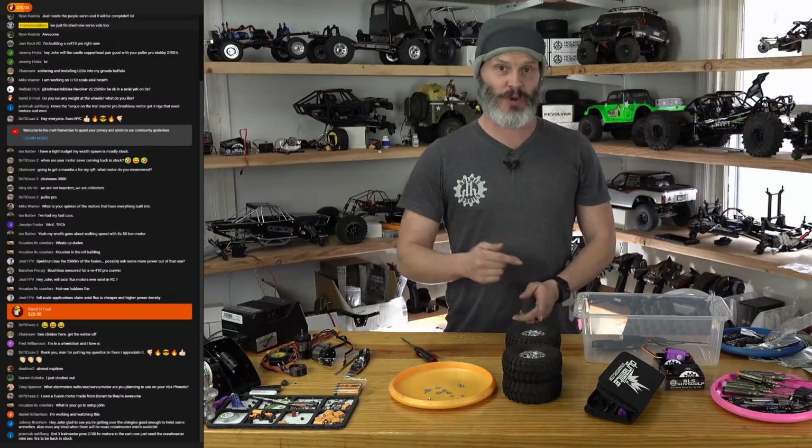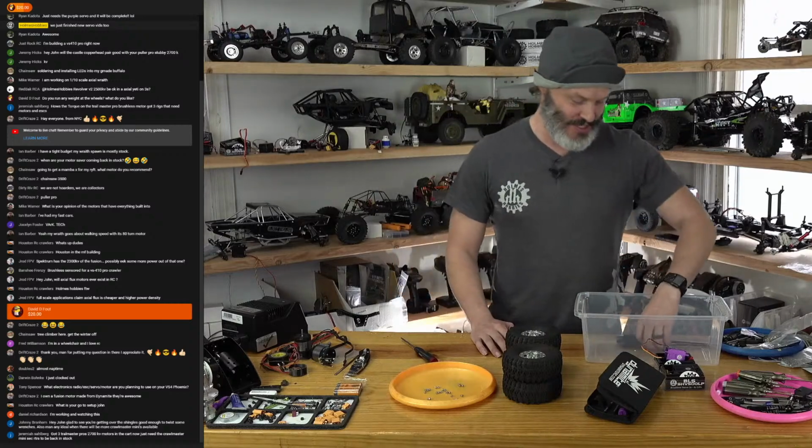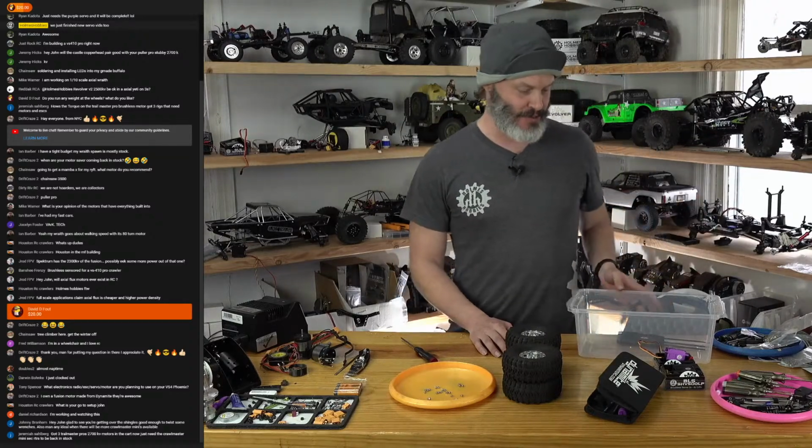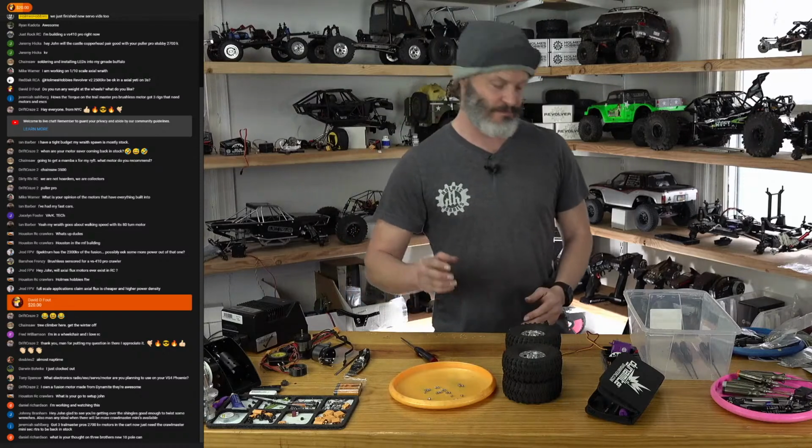Like an outrunner. If we went to a radial flux outrunner versus the axial flux, then it's really easy to get the flux gap area that we need. I could ramble for a lot of time. Answering the question, axial flux motors, do we think that we'll see them in the RC realm? I really highly doubt it. Maybe for a comp rig, you could technically print a PCB, and as long as you had a return iron path and magnets that didn't just totally blow those coils out, because they saturate really easy.